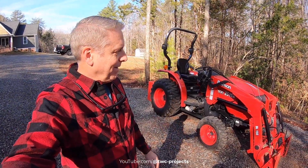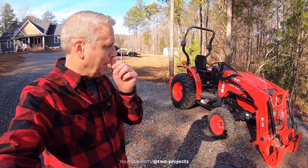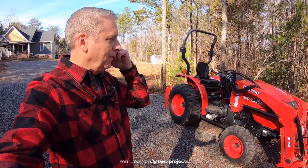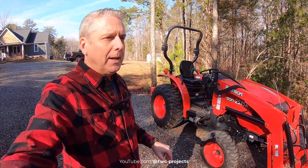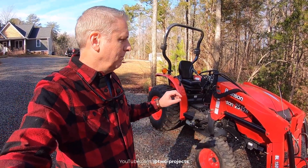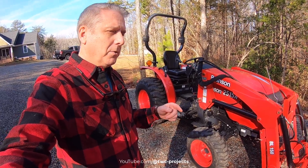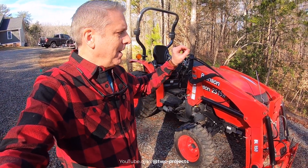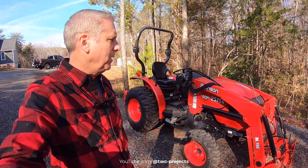All right, so I'm going to try to make this video more of showing than telling, but I do need to do a little bit of telling to start with. Some of this may be intuitive, some may not be, so bear with me. If you've changed oil on a car before, you want to run it for a little while to warm it up, 5 to 10 minutes tops, depending on how cold it is outside. We'll go through that process: you drain your oil, take out your filter, put a little fresh oil on your new filter, put it back in, make sure your drain plug is back in tight, then add your oil, run the engine for a minute, and check the dipstick. Most people know that stuff, so it's straightforward, and we're going to do that.